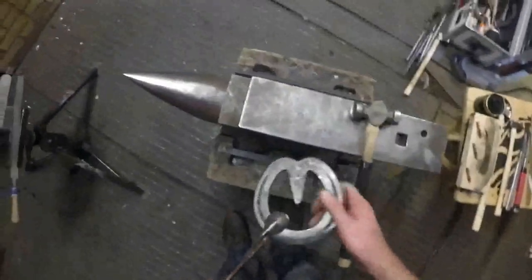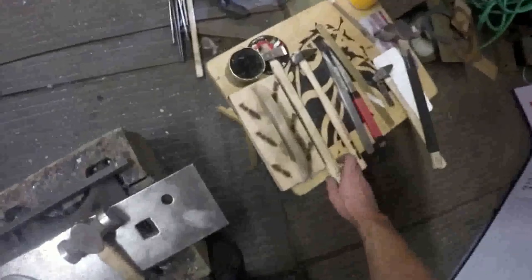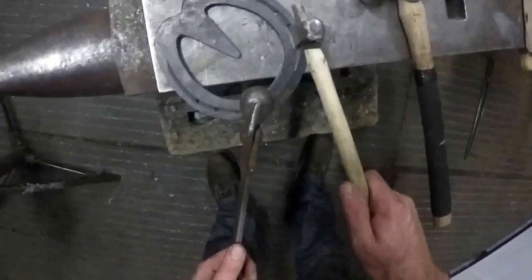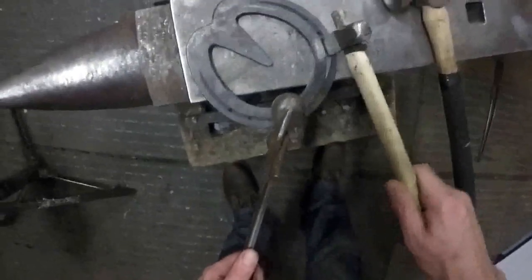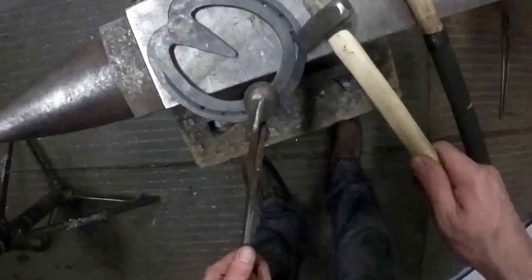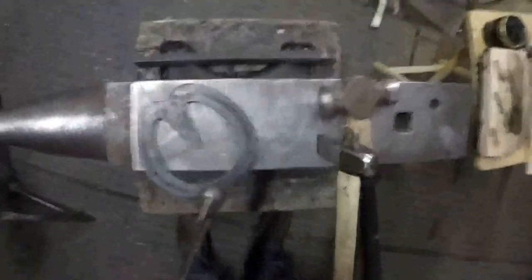So this shoe is going to come out of the fire. I just fuller one side at a time, fuller it, nail on it. So obviously I've got runouts on this, I'll put runouts on my other one. What I normally tend to do is, instead of putting a stop end in like that when I'm doing a runout, I'll just ease off the fuller a little bit, I'll get the fuller full depth from there to there, and then I'll just do probably 3/4 of the length of the fuller, and that'll be my runout, and then I know where my toenail's going to be.